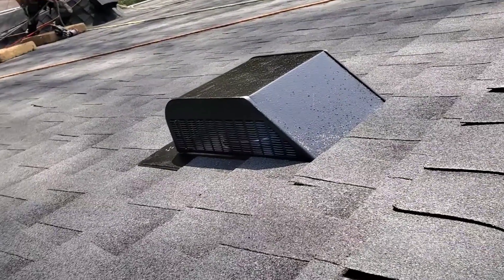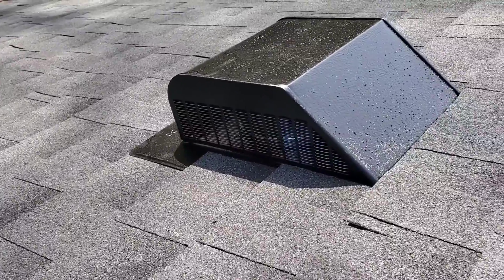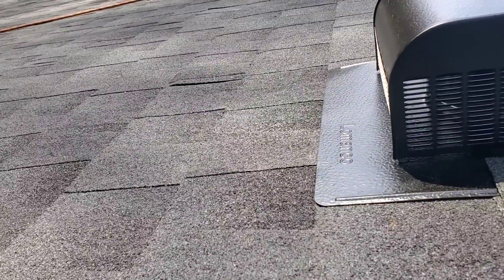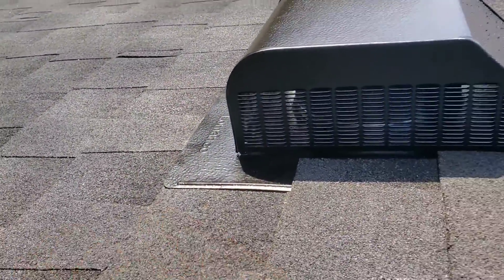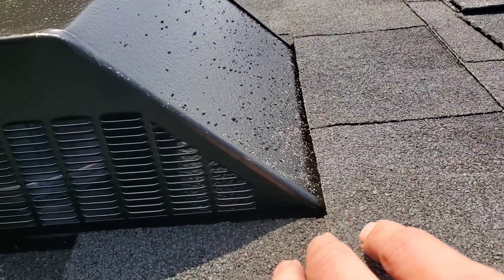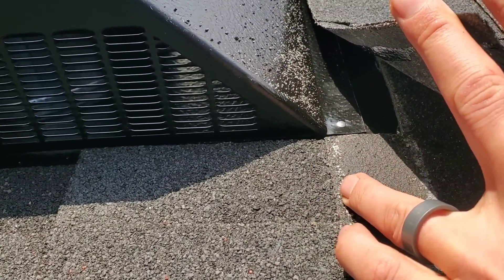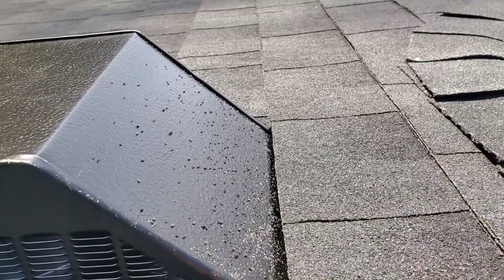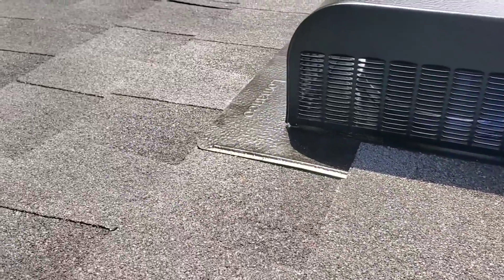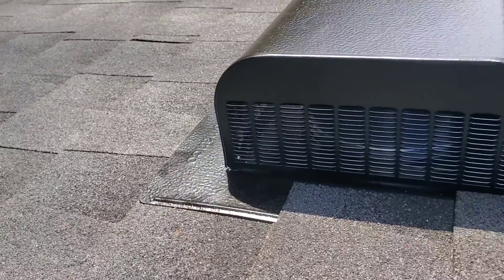This is an absolute textbook perfect install. Notice where the bottom of the box vent is at that course, and look where the top shingle lands - it involves this one. You just cut back basically right at the reveal line, and then that one runs right across the top - perfect exposure on the bottom. They're going to come back and pop two gasket screws in it, that's why it's not fastened on the bottom.